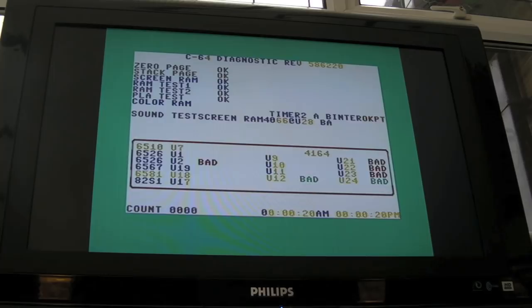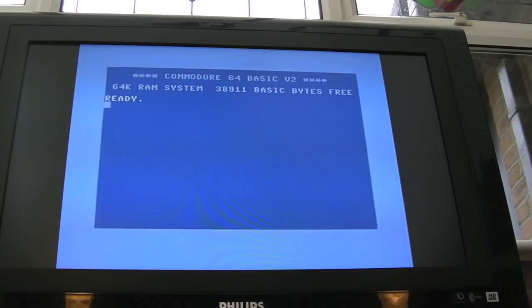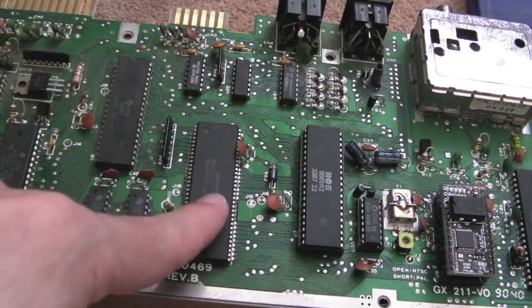I've had a think about this and I do think it's the PLA. If there was a RAM fault, games wouldn't work - that's one thing. You probably wouldn't get BASIC up as you do, and I'll show you the screen - it's showing the correct amount of bytes available. Usually if you've got a RAM fault, BASIC won't behave normally and you'll see a different value coming up there. So yeah, common sense prevailing here - common sense is pointing towards the PLA. And it could well be that the colour RAM inside there is the fault and it's just causing this weird behaviour.